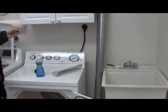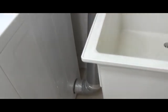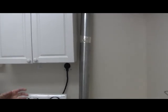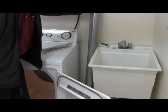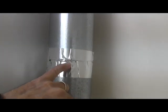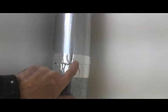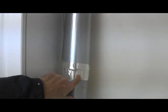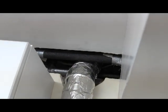In an ideal situation you would disconnect the vent from the dryer down at the bottom and check it visually to make sure it's clean. They also make brushes on a long wire that can be fed up through the pipe. You'll notice the joints of the pipe I have taped — that's because you don't want to use screws, because the screw will tend to catch lint on the tip. The type of tape I'm using is the shiny metal tape, not what they call duct tape, which is the gray cloth stuff — that stuff will dry out.